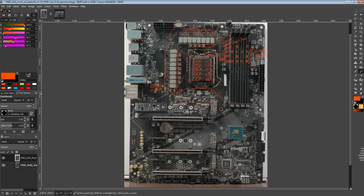If the transient response is bad, it could mean that if you have a CPU that does 5 gigahertz at, I don't know, 1.3 volts load voltage on some other motherboard, then on this board it might have to run 1.32 or 1.33 volts. That isn't necessarily that big a deal, but it does mean the CPU runs hotter, and it would be better if you didn't need the extra voltage.